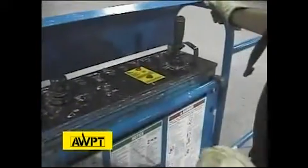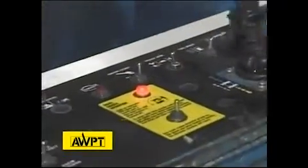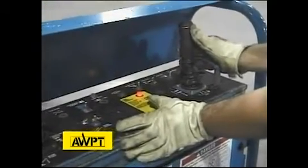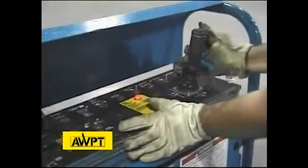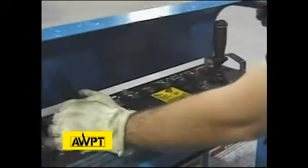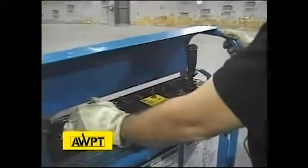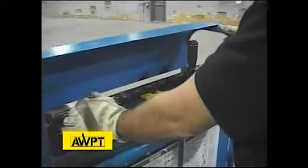Once the machine's rotated, the light comes on, drive is cut out. The machine will not drive unless you hold the enable toggle switch to regain your drive functions. So now we tested our direction, our swing, our proportionality, and our drive enable safety device. When we get the machine back in line, we'll continue our process of checking functions.